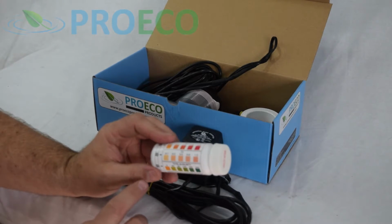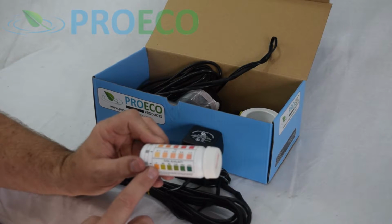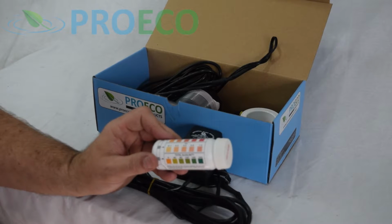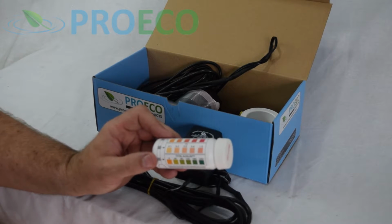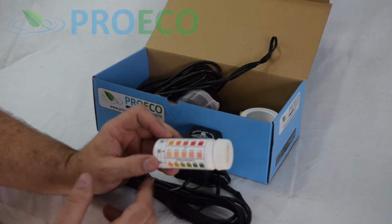The other thing we know is that anytime we try to change the pH, it's really difficult to do that when the alkalinity is high. The high alkalinity acts as a buffer, so if you try to change pH, it buffers anything we do to alter the pH. So it's really tough to change the pH when you have high alkalinity. High alkalinity also really impacts pumps and everything else on the pond. It makes it much harder. So softer water actually is okay. It actually works really well.